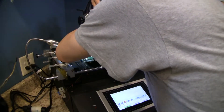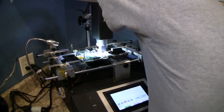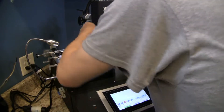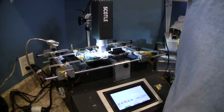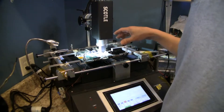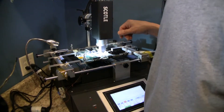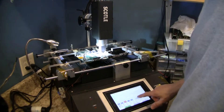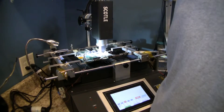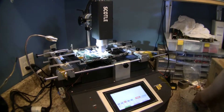We're going to go ahead and line up that chip with our nozzle. This nozzle is designed to be the same size as the chip — these chips are small so we match the size of the chip. We're going to allow the air to escape around the chip because of the adhesive; we're not going to drop down around it. We're basically flush with the chip, about a millimeter or so gap, and then we're going to start our profile and let it run through.